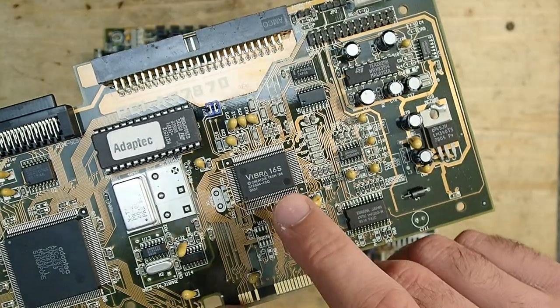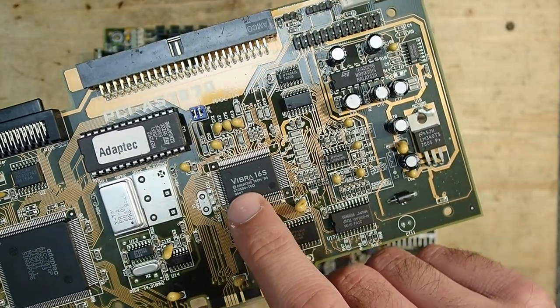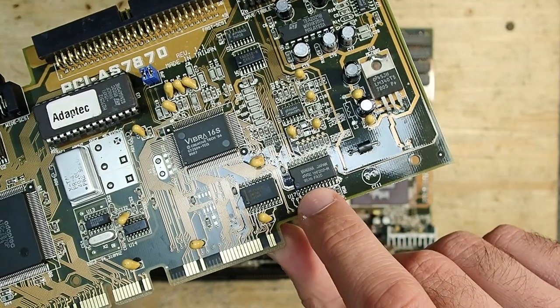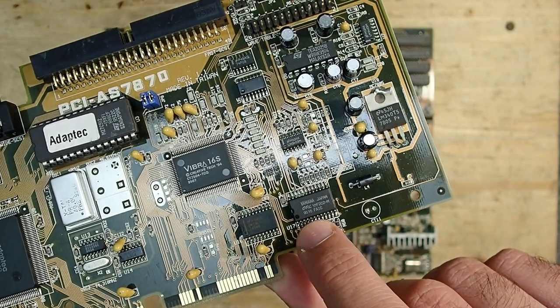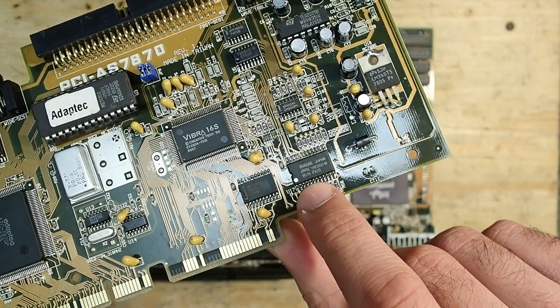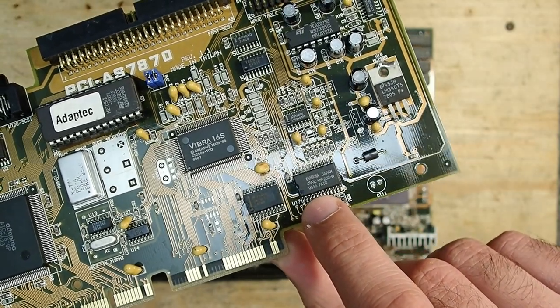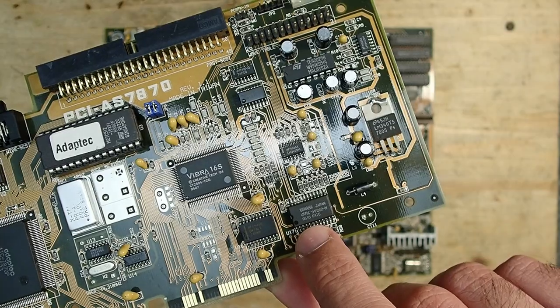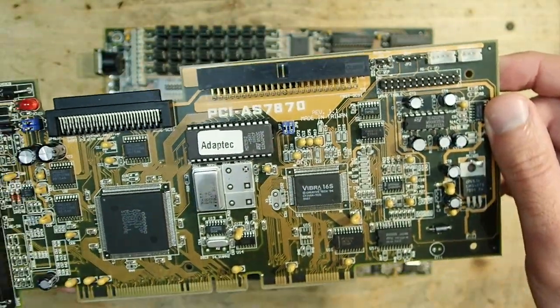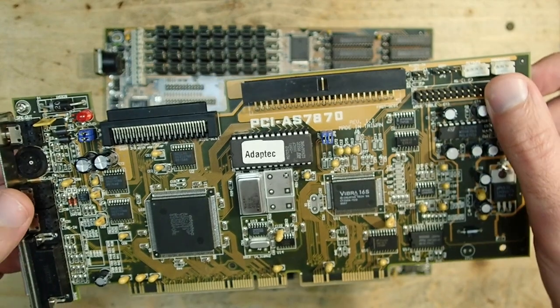I think that I don't need to explain what a Sound Blaster 16 is, but the interesting thing is that despite the compactness of the card, it still has the original Yamaha OPL3 chip, which would give a nice and genuine FM sound in the DOS games. And furthermore, it even kept the wavetable header for a daughter board and general MIDI sound.